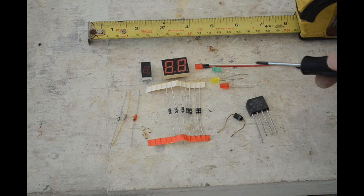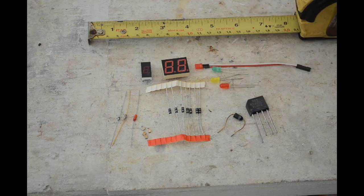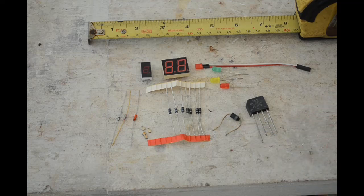So it's up to you whether you want to go after all the diodes. For me, I'll go after the LEDs, and I'll go after these small signal diodes if they'll come off the board easy. If they're going to be a pain, forget about it. I'll just leave them for the refiner. I think they're probably more trouble than they're worth. And for power diodes, I don't even mess with them unless, on the rare occasions, they have gold-plated legs.